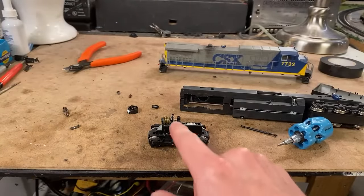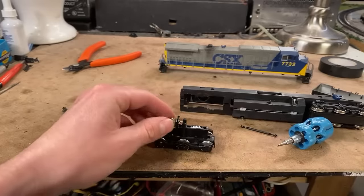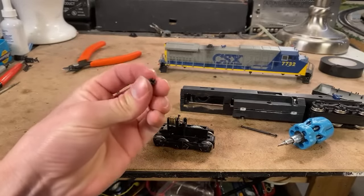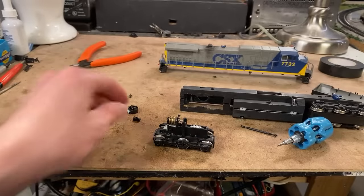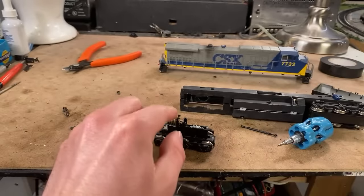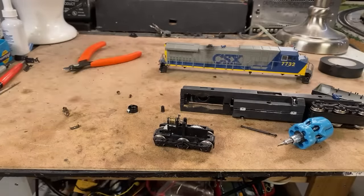And now I need to get some sort of a degreaser, because nine times out of ten there is some unwanted oil there, and I should probably try to degrease the inside of this and then add some CA. I might add the CA to this part because I really don't want it to go on that bearing. That's probably how this is going to end, but I'll try to avoid it if possible. See if I have some rubbing alcohol or something.